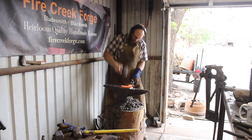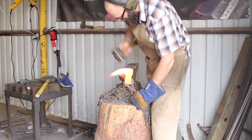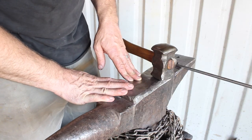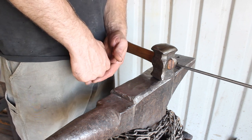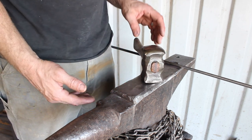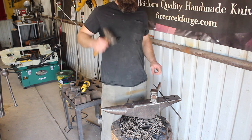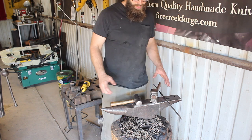Another important feature of the Fire Creek Forge hammer is the ergonomics. The forging hammer is primarily intended to be used on the anvil, so we need to start there. The height that the face of your anvil should reach is the level at which your knuckles hang as you stand with good posture and make a fist. If your anvil is higher or lower than that, you're either going to be bending over or not able to follow through on your swing completely, and all those things are going to give you problems ergonomically.